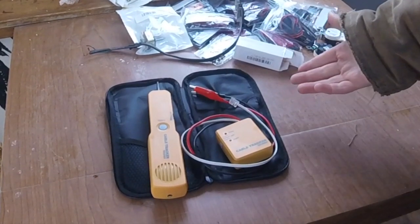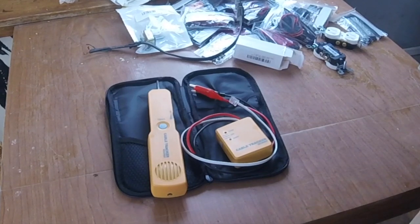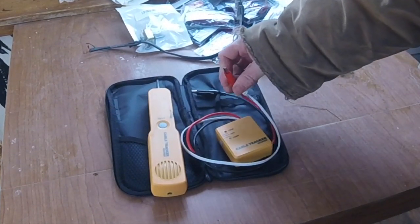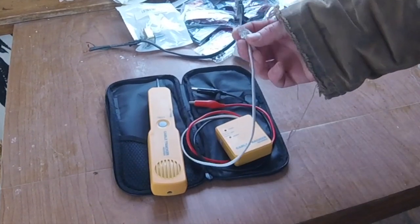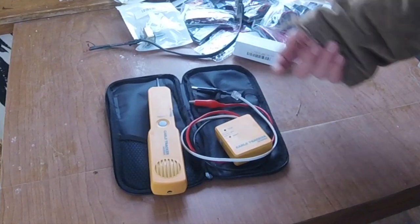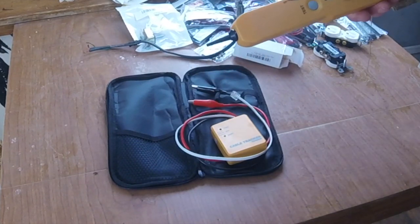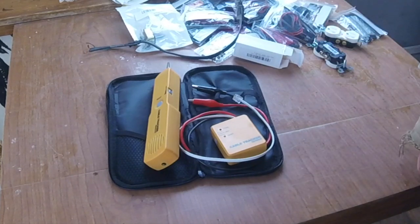That is one practical way I used the wire tracer in my Airstream camper to figure out where the wiring was going. Just a very practical way to use a cable tracker, also known as a wire tracker or wire tracer. You can get this off eBay for about $15 — it's well worth the price if you're trying to track wires, whether 12-volt, 120-volt, or any sort of wire. Now if you're dealing with 120-volt wires, be careful and shut off power. But generally these are very handy, especially for phone lines in your house. You don't have to directly touch the wires — you can be in proximity, and the closer you get, the louder the tone. It's a really handy, very cheap tool that's invaluable when tracing wires in a house, camper, or anywhere. Hope you found that helpful — thanks for watching, we'll see you in the next video.